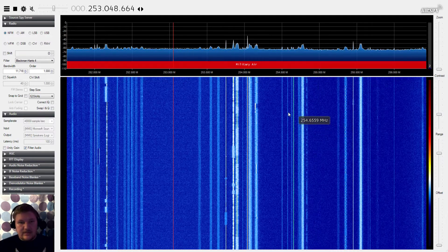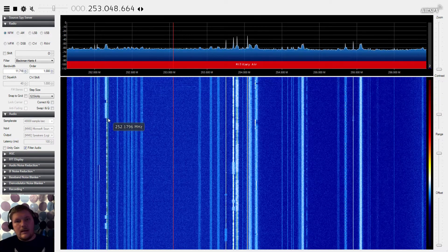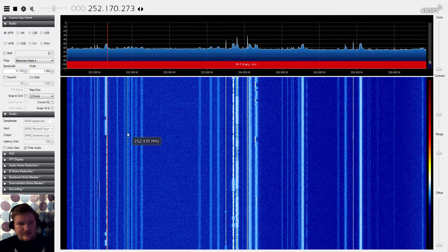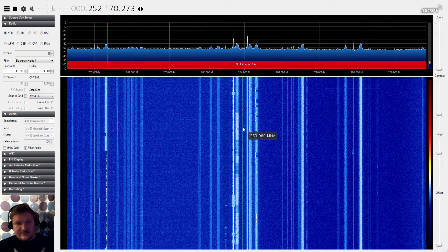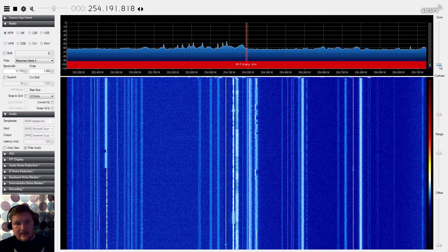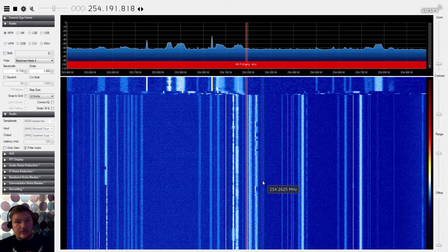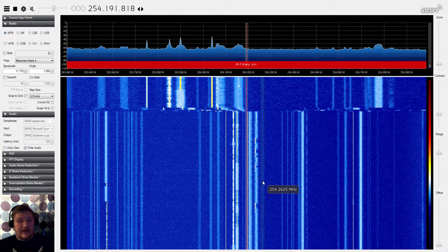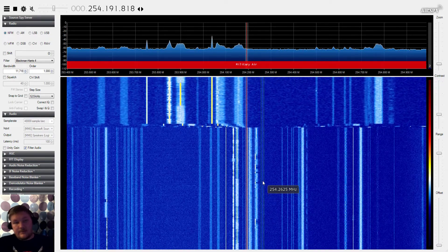What I wanted to show you in particular — I just find this very interesting — so this is one of the transponders. If I recall from the documentation, these are about 30 kilohertz wide each. You'll notice there's actually a lot of pirate radio activity going on with these. If you look at these different transponders and zoom into one, you can see the characteristics of the transmitting radio. So while the transponder may be 30 kilohertz wide, somebody might only be transmitting in narrowband FM at 12 and a half kilohertz.